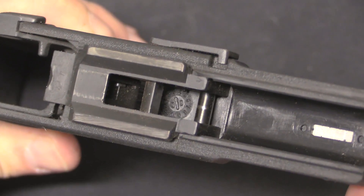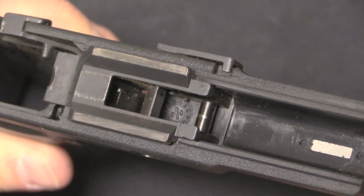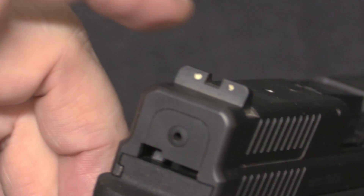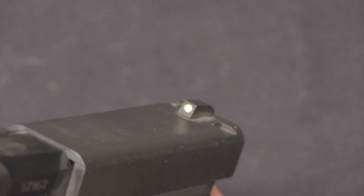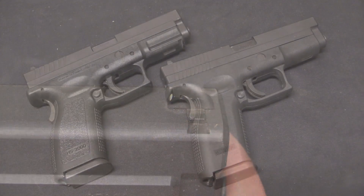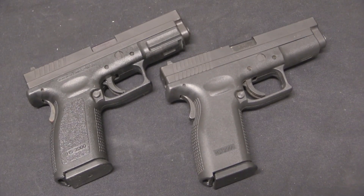If we take this apart and look at the production date stamp, this one is May of 2000 — just about a year later. The sights have also been changed: we still have the same square notch, but now instead of a white stripe we have two white dots. The front sight is still a single white dot, but it is now windage adjustable — dovetailed into the slide. Even as this export contract was being produced, changes and improvements were being made to the design; this is a constant development cycle on a fairly fast time frame.